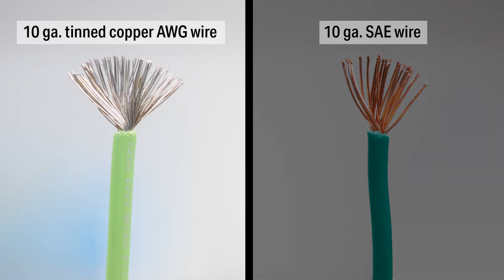And finally, you can see that the copper strands in the marine wire are much thinner. This is so that the wire will be more flexible in tight spaces and will tolerate the constant motion and vibrations of boating. Even the insulation is built to offer better flexibility and resistance to moisture, oil, and heat than automotive wire insulation. So the answer is clear.